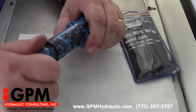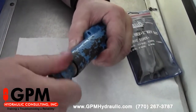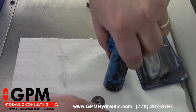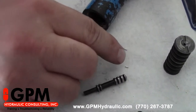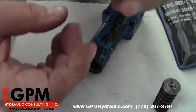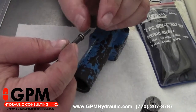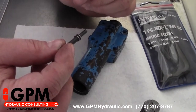As you can see we have the compensator off of the pump. To remove the spool and spring assembly, back your compensator adjustment out. Give it a little tap and bring the spool out — and look at that, we found some contamination. It almost looks like needle bearings. That contamination became lodged in our compensator spool, causing it to stick in the open position, which ported oil to our stroking cylinder, moved the swash plate back, and the pump was putting out very little flow — giving us a low pressure situation.